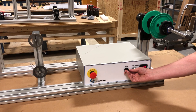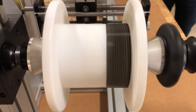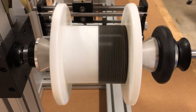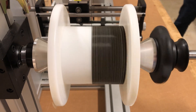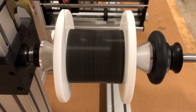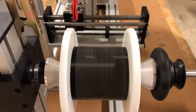So let's just give it some speed. The machine can run up to 400 RPM of the take-up with a standard motor — we're probably doing about 120 or so right here. And if you come around, you can see our counter measuring the length, and it will stop at the 120. You can hear and see the traverse turned around at the flange. It's currently at 65 meters, so we're about halfway there.